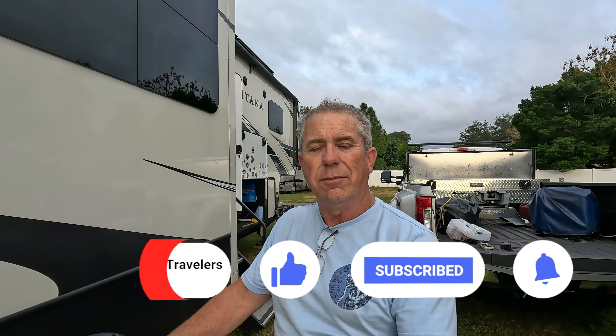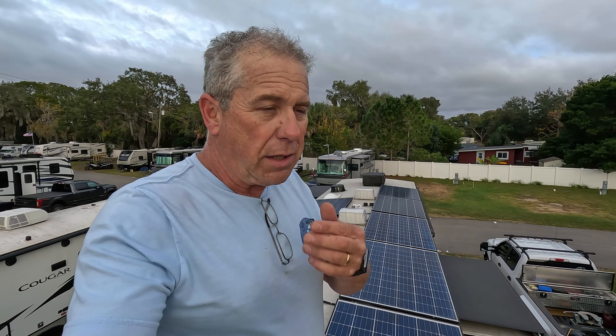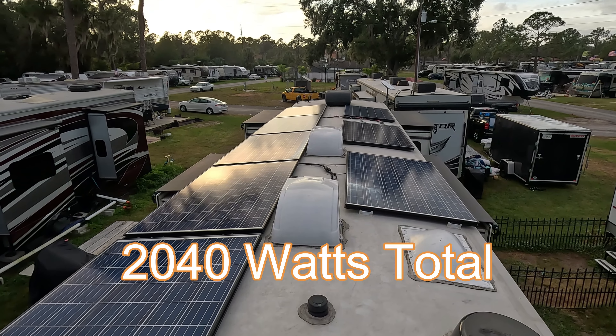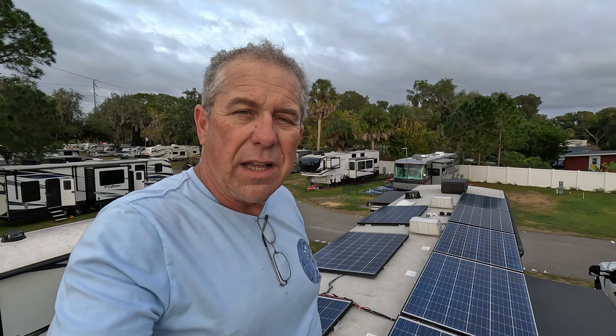While we were talking about solar, we stayed with Santan Solar. Santan Solar had two stores — a store in Gilbert, Arizona and one in Savannah. I got wind that the Savannah store was closing, so I made a call down there to find out what they had that I might be interested in as they closed the doors. As you can see behind me, we bought four more panels on the back, so we've got just a touch over 2,000 watts of solar on the roof, hooked in series-parallel — two sets of four.